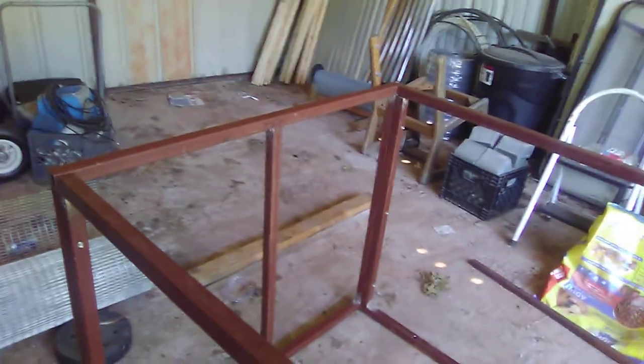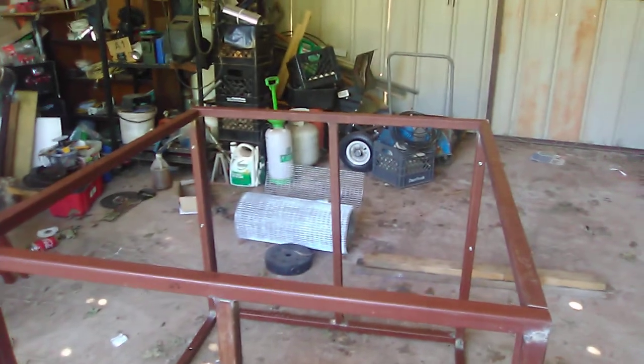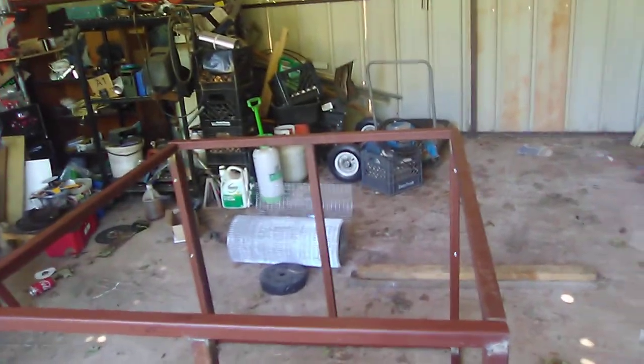I built this where it's screwed together. You'll see in here — I got three screws in each corner. I made this so it would sit in there, and if you ever had to get into the well to work on it, all you'd have to do is take the metal off the top, take those screws out, and this panel here will come off. That way you can get into the well — even if you have to pull it. I got it on both sides: this side will come off, that side will come off, and that side there will come off. So if you have to pull the casing or anything, you just take these two off and you can get into it.